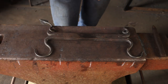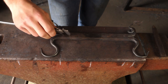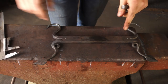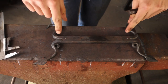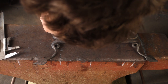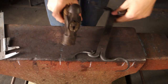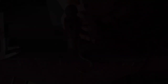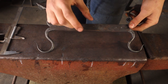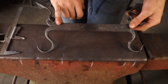So to get that next scribe line on, I'm going to put the edge of the calipers into the little centre punch mark that we've already done and then just scribe my line. So these are going to be the holes which we can screw it onto the wall, and then these two that I've just scribed and am dotting now are going to be the first hooks. These four are for the hooks — I'll drill those at about 6.5mm so we've got a little bit of leeway to get the rivets in. And then these two I'll drill at about 4.5mm and that's for the screws.